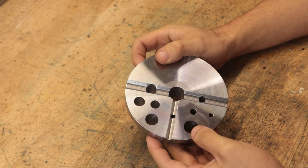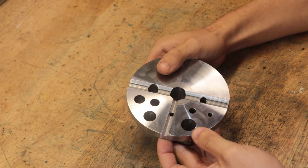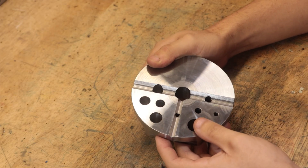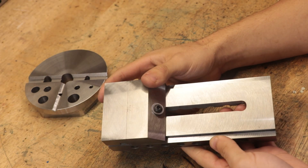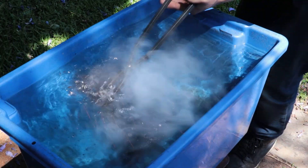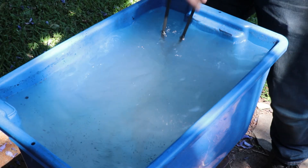The raw stock wasn't pre-hardened, so it wasn't very hard — if I started to hammer it, I'd leave quite a few dents. Whilst 4140 can be hardened, I do need to be careful about how I go about it. 4140 is an alloy steel, and it's a lot more sensitive to heat treatment than the carbon steel I normally use. When heat treating carbon steel, I never worry much about whether I'm using oil or salt water as a quenching medium — unless I'm worried about warping, I generally use water because it's a lot easier to set up. With 4140, however, there is less room for error.